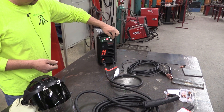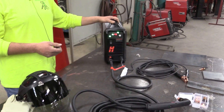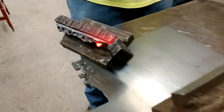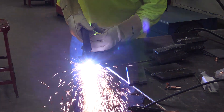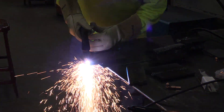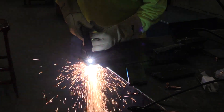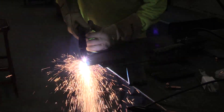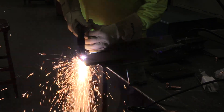The amperage control goes from 10 amps all the way up to 45 amps. The machine is rated for 7/8-inch-thick plate, though you might be able to sever it but not get a real nice cut. At 45 amps it'll cut quarter-inch all day long, do pretty well at 3/8-inch, and I'd say half-inch is probably its max. Most of the time, unless you're running thinner sheet metal, anything 3/16 and above I'd run at 40 to 45 amps. For real thin stuff like 16, 18, or 20 gauge, drop it to the 20 to 25 amp range and use your fine cut tips.